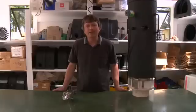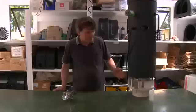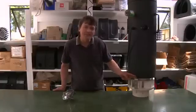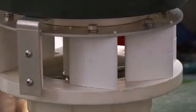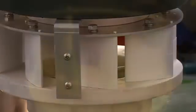What I'd like to point out now is some of the features that our product has. This includes the automatic cleaner. What happens here is that every 10 minutes a timer inside the hydro turbine will start the cleaner, and that will rotate twice for approximately two minutes and then it will turn off again for 10 minutes.